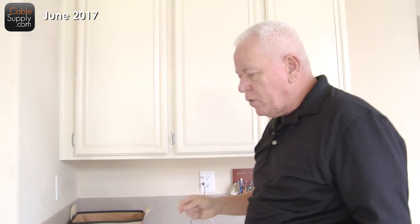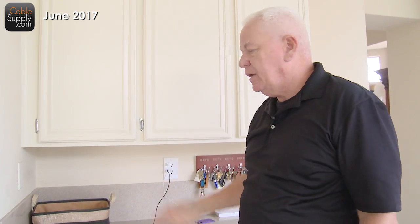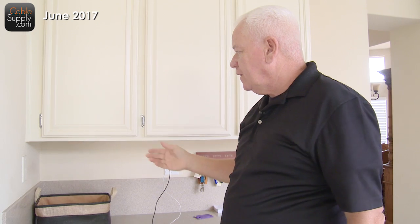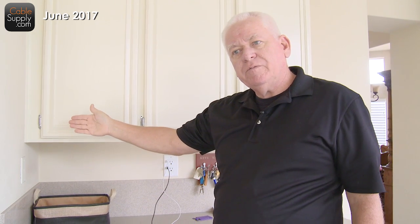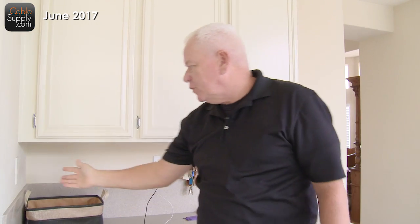What is a home run to a computer person? It means one cable goes from that patch panel to one jack — that's it. You don't have more than one jack attached to that cable. That's what's required in computer networking, and it's a star configuration because each cable goes out from that patch panel, and the patch panel is connected to the switch. About 20 to 25 years ago, what people called a home run was like a ball bouncing out and hitting the ground again and again — that's what this old cable design is in old houses.